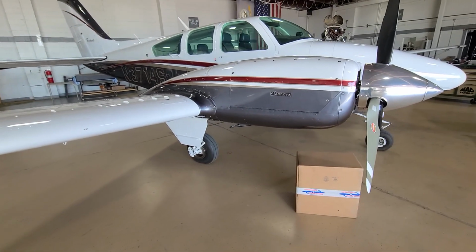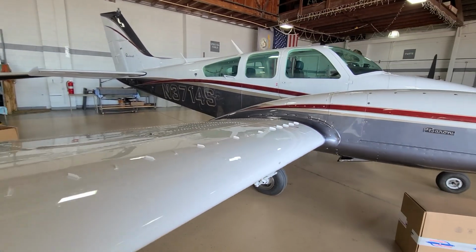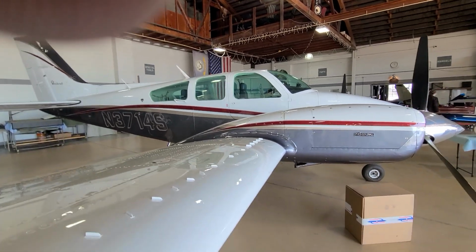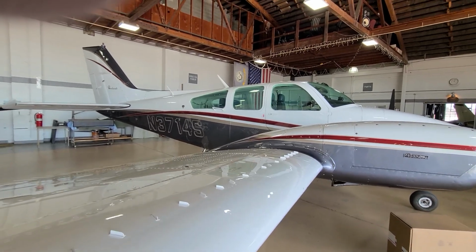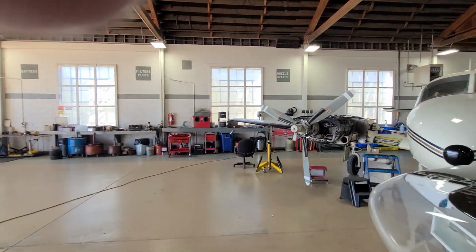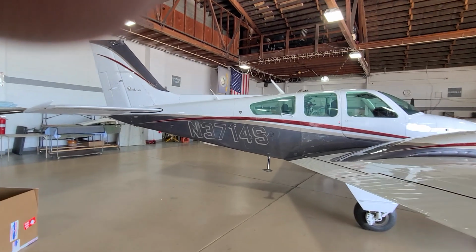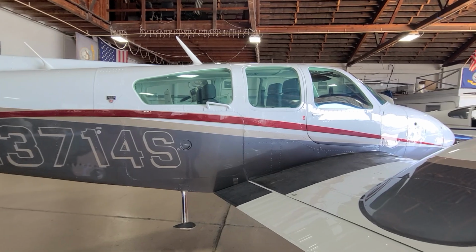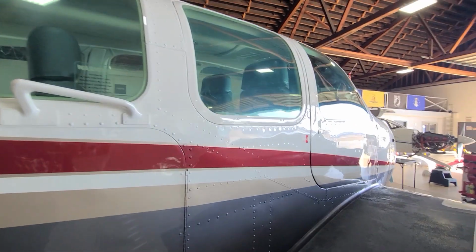Anyway, we have them, and they're supposed to crank the engine at about 300 RPM is what I was told. So we're hoping it solves the problem. Another thing the owner and I talked about was, during the start process, if it pops and doesn't light, maybe we should do a procedure where you keep cranking, pull the mixture off, shut the mag off, shut the EIS off, and then release the starter.